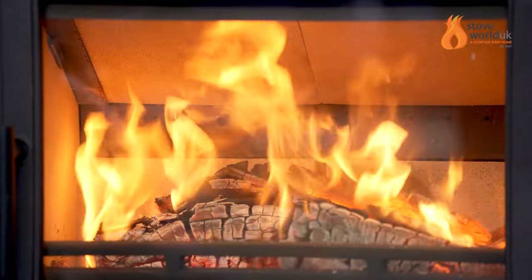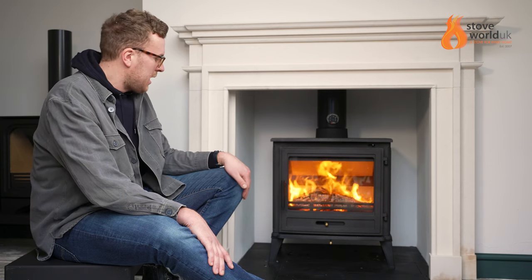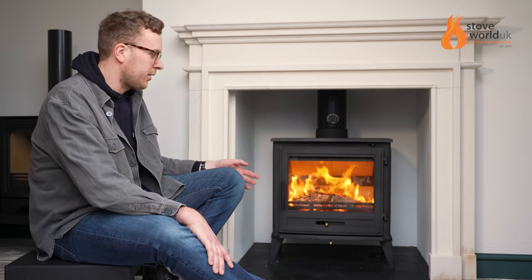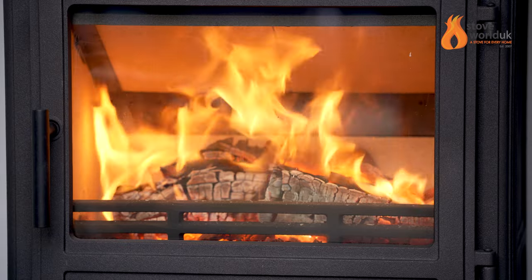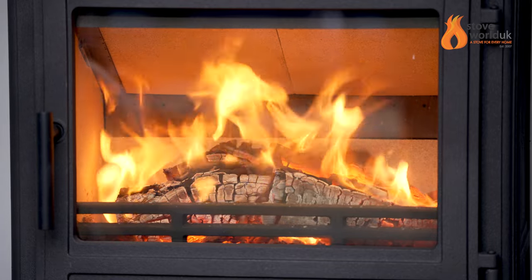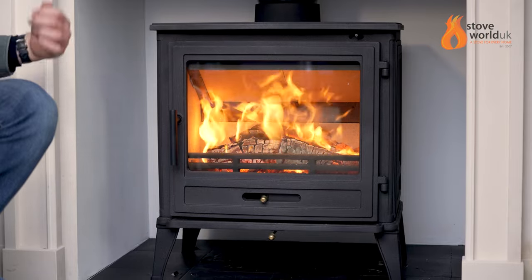The stove's looking very black at the moment, but if it does get dirty you can buy stove polishes online or just do a quick touch up with some paint — it refreshes them beautifully. The glass is kept very clean with the air wash system. As you can see, if you're burning dry wood it will stay nice and clean. If it starts going black, and if the bricks and sides start going black, you can generally assume that wet wood is being burnt, or the stove is being run too slow — the two combined really make it go dirty. If you want to clean the glass, you can buy HG glass cleaner or other stove cleaners, or simply dip a wet cloth in the ash when it's cold, give it a scrub, and the final bits of residue are generally burnt off when the stove gets up to temperature.